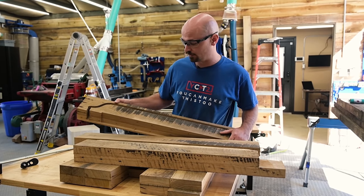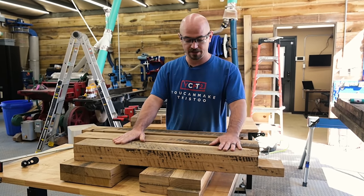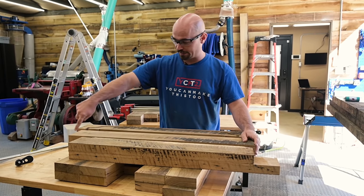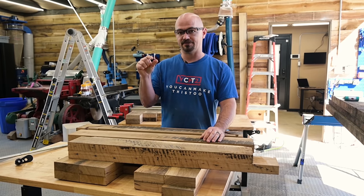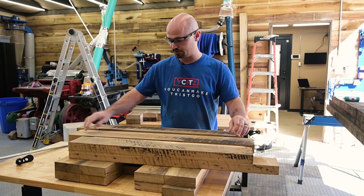It's just gonna be flat all the way across. This half inch groove though was quite a lot for the CNC. So the first thing we're gonna do to these pieces is rip them down closer to width. So when that bit comes along and cuts the perimeter, it doesn't have to hog out its whole width. It'll just take a little bit off each side. That'll take a lot of stress off the machine.